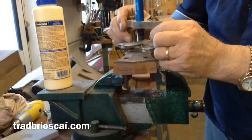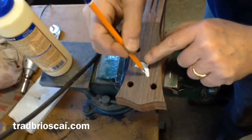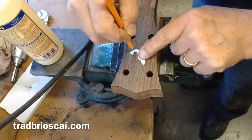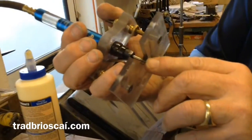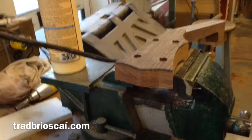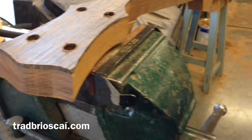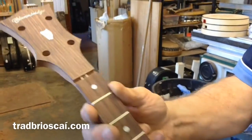And this runs on air. This is done by hand. On here is all the inlay pieces. If we want to put a fish in there, what we do is take the fish and we draw around it, and then you follow the outline. This little very fine cutter here, and that leaves a cavity. You pop that in with epoxy and you flatten it up. This is a kind of a finished product in the context of the name, the harp and the dots.